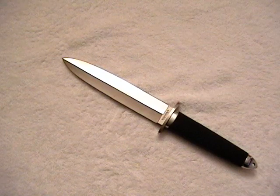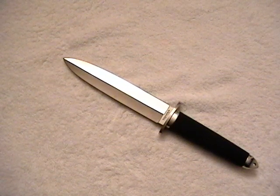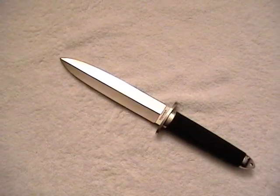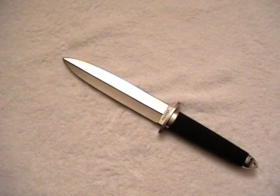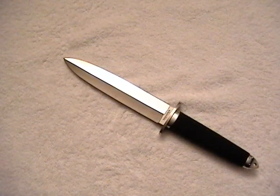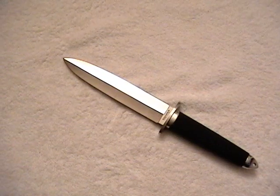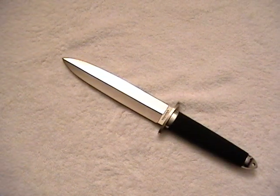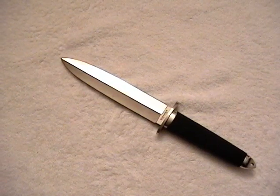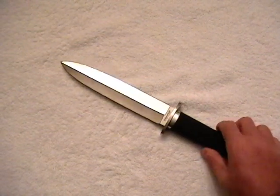It says a simple way to think of Sanmai 3 blade construction is to imagine a sandwich. The meat center is a hard high carbon steel, and the pieces of bread on either side are a lower carbon. The edge of the blade should be hard to maximize edge holding ability, but if the entire blade was hard, it could be damaged during the rigors of battle. For ultimate toughness, the body of the blade must be able to withstand impact and lateral stresses. Toughness is generally associated with softness and flexibility in steel, so, surprisingly, if the blade were made tough, the edges wouldn't be hard enough to offer superior edge holding. So Sanmai 3 blades provide a blade with a hard, high-carbon steel in the middle for a keen, long-lasting edge, and a tougher, i.e. softer, lower-carbon steel along the sides for flexibility.